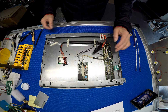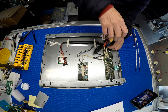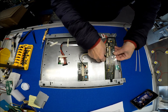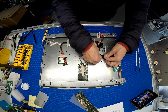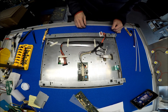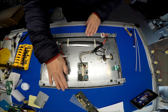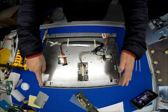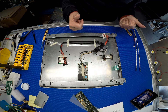So next thing, we're going to remove all the screws, take it out, and lift up this end. Lift up the board, and then disconnect the touchscreen — push up the nubs. Next, we're going to take out this back chassis, held by four screws — one, two, three, four. Then we can lift up and see what kind of screen it is.